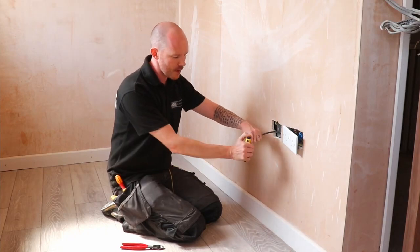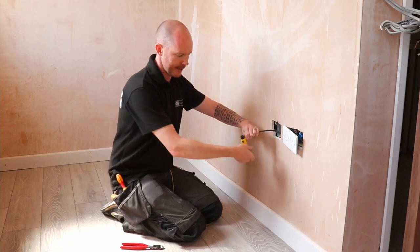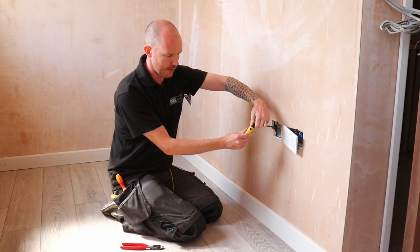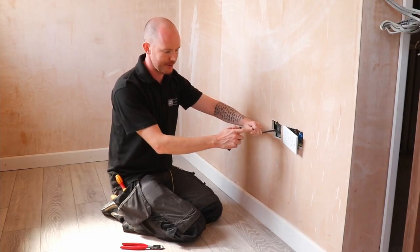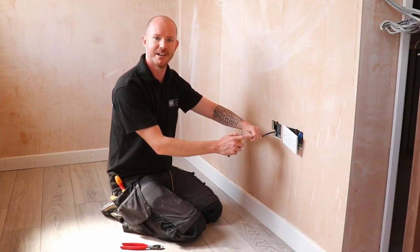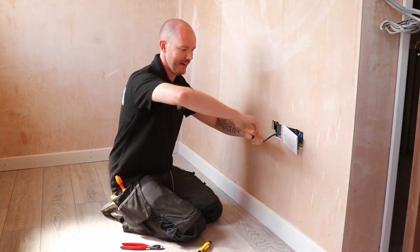What I found: short blade inside, put it in, give it one twist, then pull the blade up and give it another twist. The reason you pull the blade up is that if you don't — as I found in my practice run — it doesn't strip the outer layer. But that's it, that's ready to go.